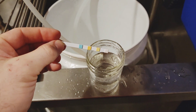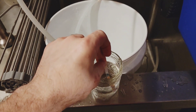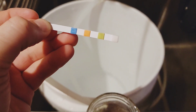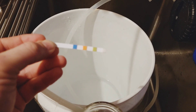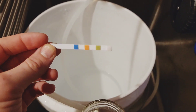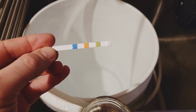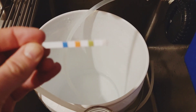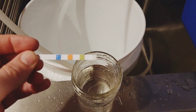We've got our water sample from the carbon filter flushed water. We'll just dip in and take a look — it looks completely white, which is good. Don't see that slight hue of purple. It might be hard for the camera to pick up, but to the naked eye this is much more pure white versus a slight lavender hue. It looks like we're effectively at zero ppm for chlorine, which is a good sign, so we can go ahead and finish rinsing our membranes.